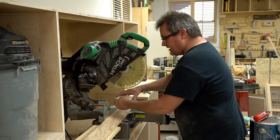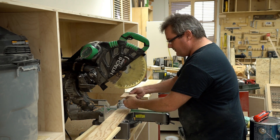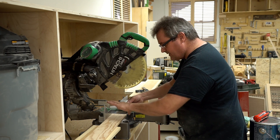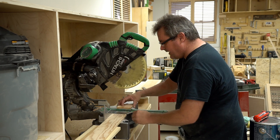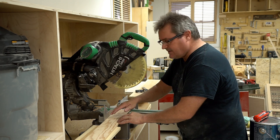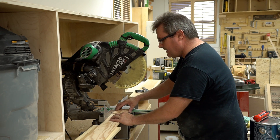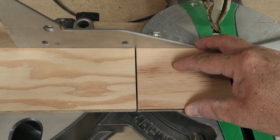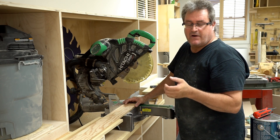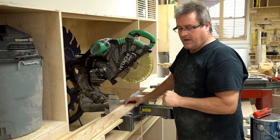What I'm going to do now is take that block I just cut off, flip it over 180 degrees, slide my longer piece down against the fence, and slide this piece in against it — assuming of course that this fence is perfectly straight, which this one is, I checked it already. This will give you an idea of how close your cut is to perfect. That looks really good to me — that's as far as I'm going to take it. You can go further with the five-cut method.